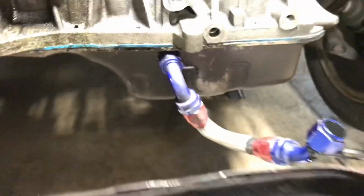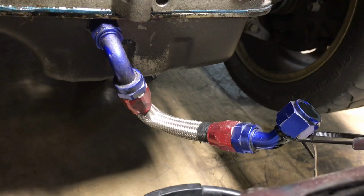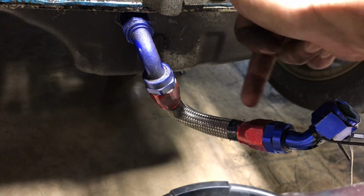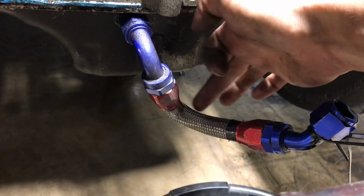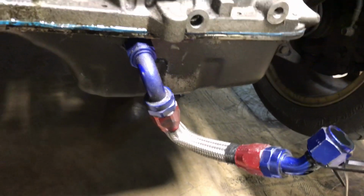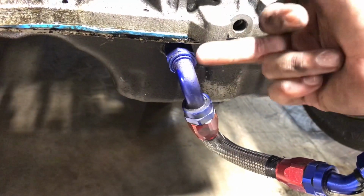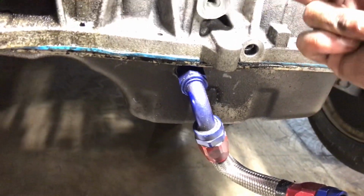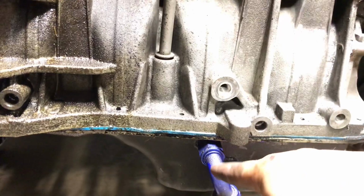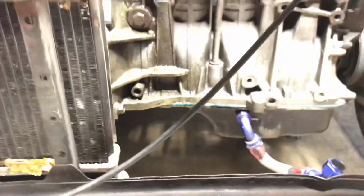One thing I saw also was the way this drain was set up, basically just the way you see it there. And you really never want it to come down and back up, because the oil will get stuck here and not drain from your turbo back to your pan. So now he's going to be getting a top mount setup, so this 90 can basically come up and right to the turbo. Should be somewhere around here, and then it'll drain nice back down to the pan. That way it doesn't suffocate the turbo with oil.